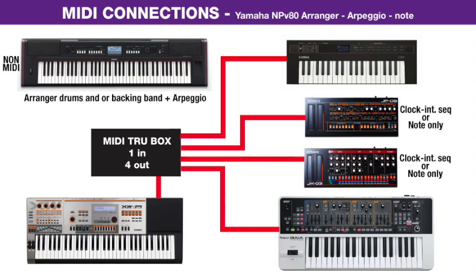It just does not interface with my system very well, especially when you're trying to play more keyboards. When you're planning to play more than one keyboard and one is out of reach, you'd want to control that from another keyboard sitting in front of you. So for synth jams, these keyboards without the 5-pin MIDI connections are totally useless to me. And it's very difficult to use this, and I'm going to sell it if anybody would buy it. And I will replace it with something like a Yamaha MX-49 that has the standard in and out MIDI.